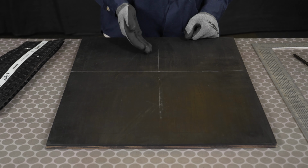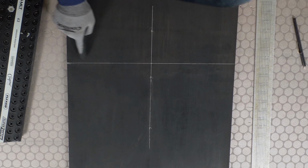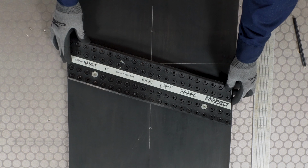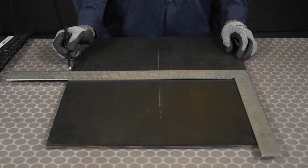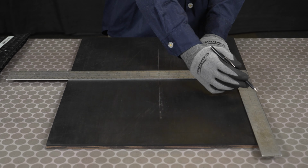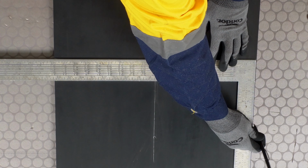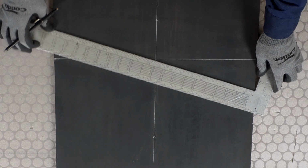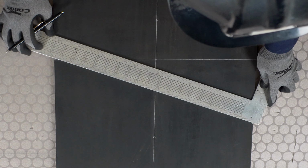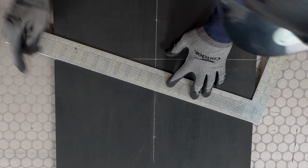Square the belt using the centerline method and mark a perpendicular line across the belt. Lay the splice face up on the belt to visualize the bias. To create the bias cut lines, measure a distance off one end of the squared line equal to 1/3 of the belt width. Ensure the orientation of the line is correct for the orientation of the splice. Draw the bias line.